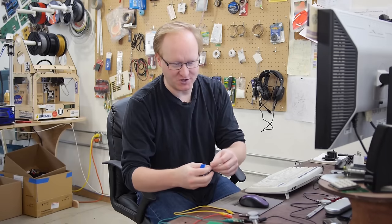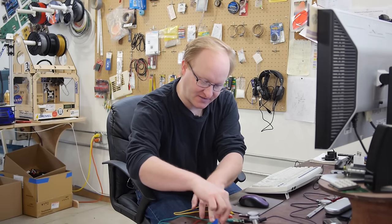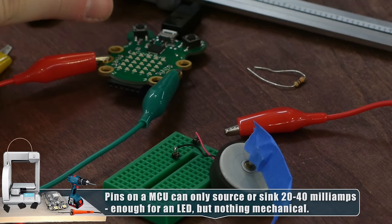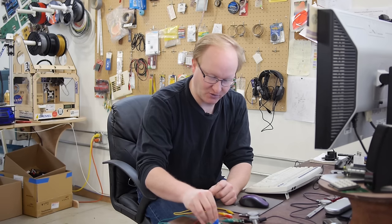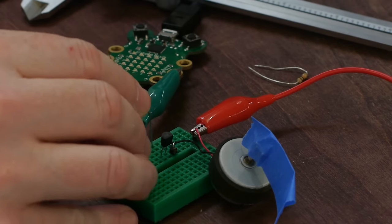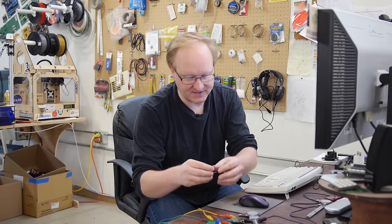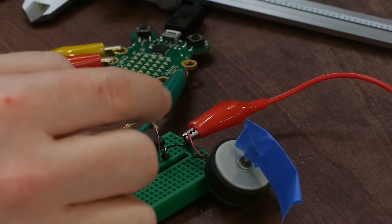For the next example, we're going to control something in the real world. I have this small rumble motor. We should be able to drive this using the five volts in the USB line, so I'm going to hook it up with a transistor. Transistors are good for controlling things that are separate from your main microcontroller. If you want to control an external load, you shouldn't try to drive a motor directly off a microcontroller — it might work, but you could damage it. There's a certain limit to what you can source or sink with the pins. I'm putting positive voltage into the motor, and the ground of the motor is going into the collector of the NPN transistor.